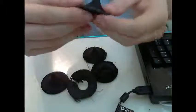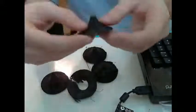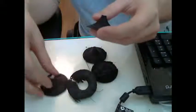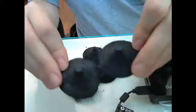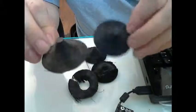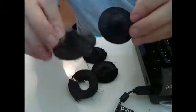I may actually use Slicer a bit more. There's a little bit of bumps here and there, but nothing where you can see the infill. Overall I was really impressed. For the last attempt I tried making it a little bit tighter, and you can see the tighter fit left a little bit more marks — more white where the interface layer was attached. I was still able to peel it off, but it left some marks. If you're acetone washing or painting over it, I don't think it really matters.